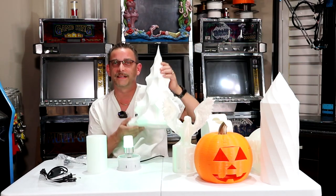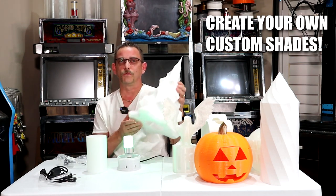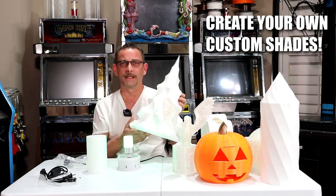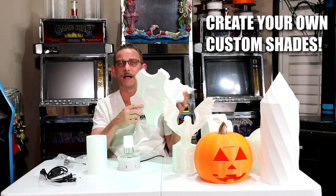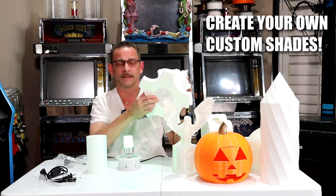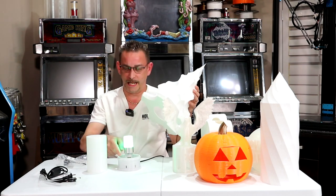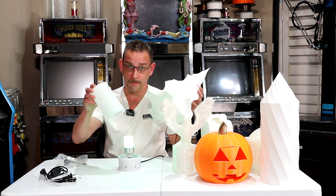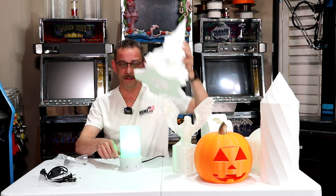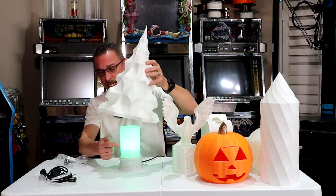These are some of the holiday shades that I made. All you have to do is find a shade that you want — say on Thingiverse or any other 3D print website — and modify it. The part that you have to modify is the hole right here, the insert hole. I measured it to be 101.5 millimeters, and that will fit around this upper ring here. This you could keep on because it fits on the inside of the ring. If you need a light diffuser, you can keep that shade on.